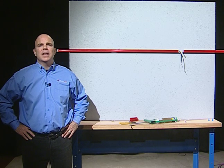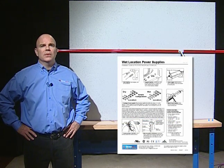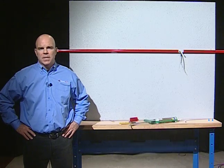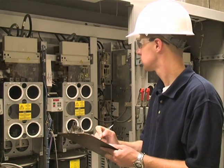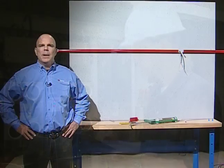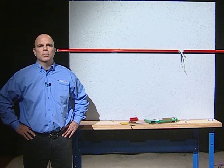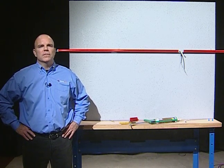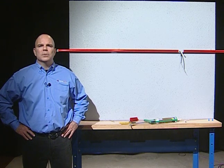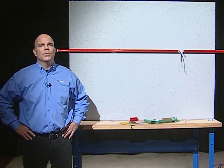Power supply connection. You are now ready for electrical connections. Refer to the wet location 24 volt DC power supply guide included. Make sure to check local electrical building codes. It is always important to stay compliant with all codes. Remember to disconnect power before you service or install any electrical product. Identify primary wires, secondary wires and the location of the mounting tabs. Secure power supplies to a junction box. Power supplies may be joined together in a wide array of configurations.